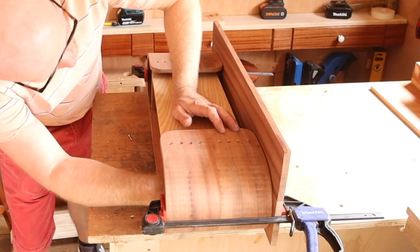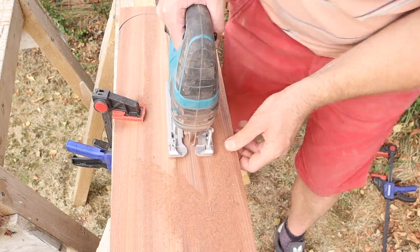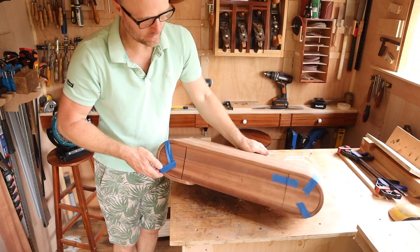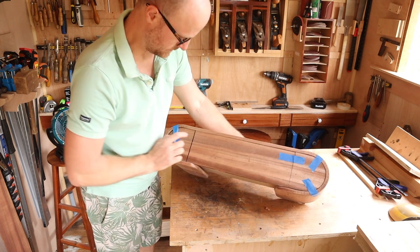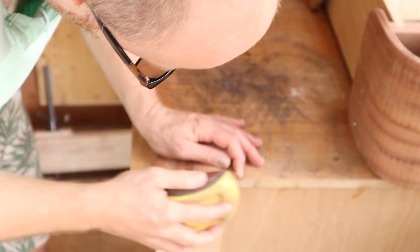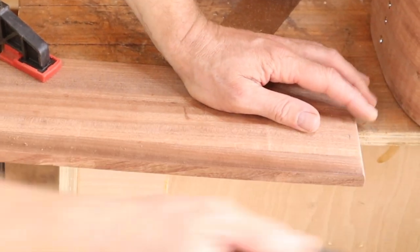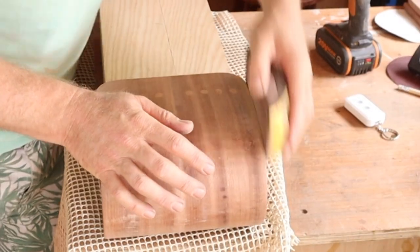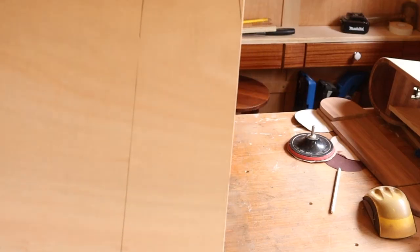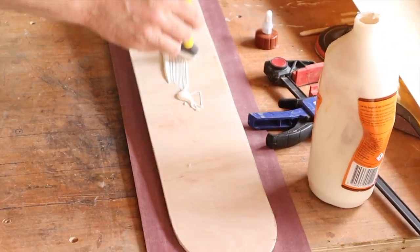Here's the board we left the center of earlier - I left the center because it was the nicest grain pattern. I just scribed through the piece that we were going to match the front to, cut it with the jigsaw into a rough size and then slotted it inside of the curves with a little bit of fine tuning. What I wanted was two fixed panels, a continuous grain and then the drawer front in the middle. I gave everything a final sand and did the same scribing to get a back piece out of a piece of 5mm plywood, then cut it out with a jigsaw and it slotted nicely into the back after a little bit of fine tuning.